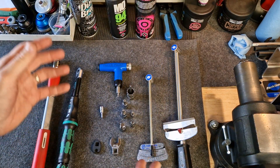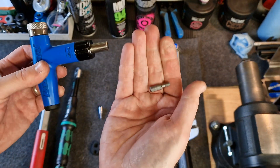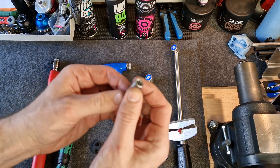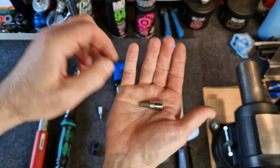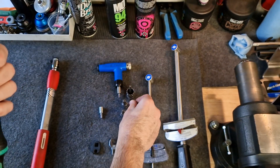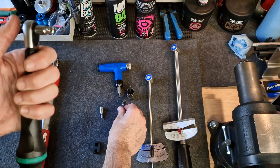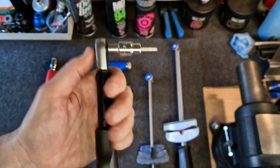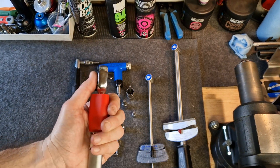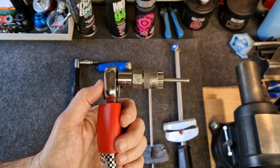So those are your types of torque wrenches. Now for adapters or bits you might need: as I showed you, the small one comes with a few bits — a standard screwdriver-type bit. You might also use the smallest type of socket set bit here, a quarter-inch drive, which fits directly onto the torque wrench. If you've got larger bits you might need to use an adapter, which simply goes on the end to allow you to use a larger bit. On the big torque wrench, if I wanted to fit a cassette, for example, I've got an adapter and an adapter to fit my cassette lock ring tool.